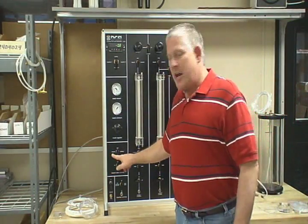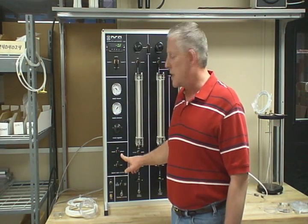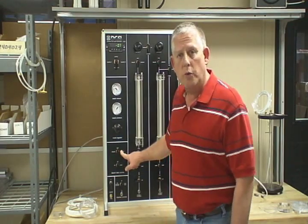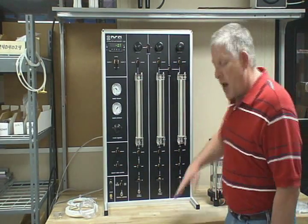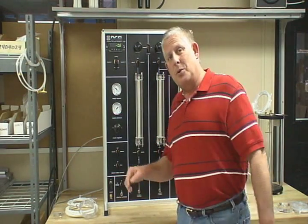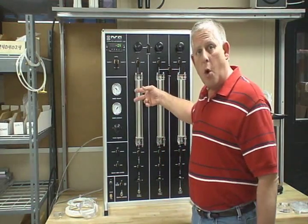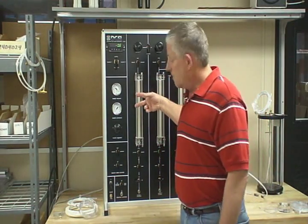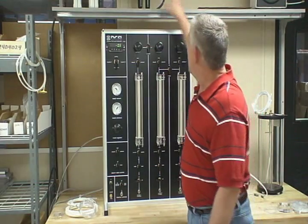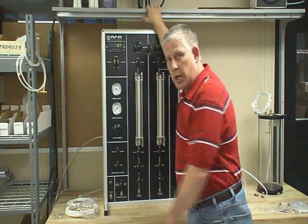You can put a vacuum on your de-airing tank or you can pressurize it. The pressurized side of the de-airing controls pressurizes this tank in case you have the tank below the panel. If you have it below the panel, you'll have to put 7 to 10 psi pressure on it to force the water into the burets. If you have the de-airing tank above, all you need to do is use gravity feed — you won't need the pressure side.